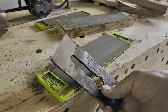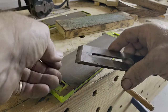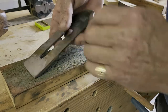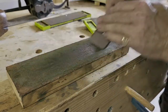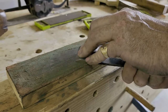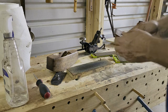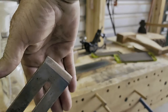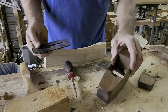It's taken about 45 minutes to get it to this level. You can see a little bit on the corners, which I think is fine. There's a burr on the front that I can feel — and you need that burr. I'm not even going to hit this on the stone anymore; I'm going to move directly to the strop and take that burr off on the bevel side. Just hit it about 40 times. Look at the shine on the very tip — all shined and polished right on the tip. The burr is gone. This thing is unbelievably sharp.